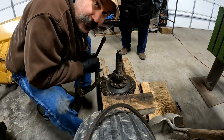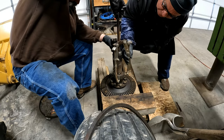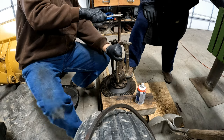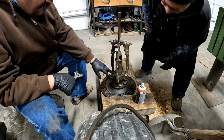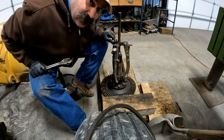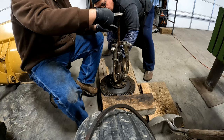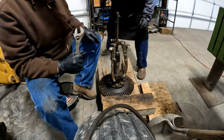This is wishful thinking, Act 2. Am I going to have enough? There? Yeah, it's in all the way. All right, go ahead, tighten it. Get some pressure on it. Maybe we'll heat it. It's got a quarter inch to go to get off of that lip. This puller was a $5 yard sale find, and it was rusty, but... All right, sir, where are you going? So I'm pulling this towards me, so it's going to want to spin clockwise. Okay, I need to go like this. There you go. All right. Ready? Yeah. All right, we got pressure on it. Let's put a little heat on that.